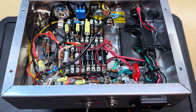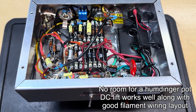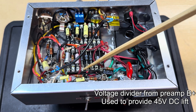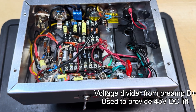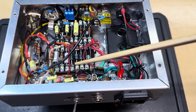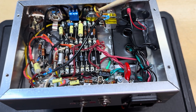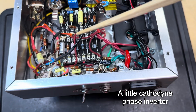It's a pretty simple design. Because this is using 12AX7s in a really small space, I thought I might need some noise reduction on the filament supply, so I used some extra spaces on my little turret board to make a little DC lift for the filament voltage supply. This other stuff here is my tone stack, and I also have some components for my phase inverter on this board.